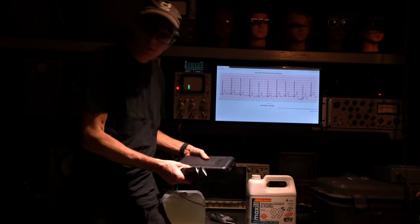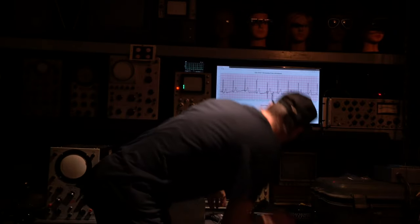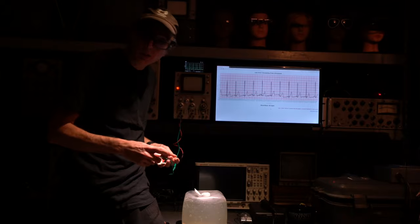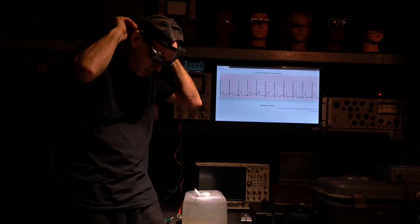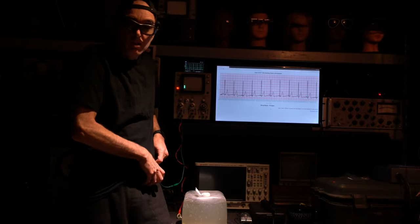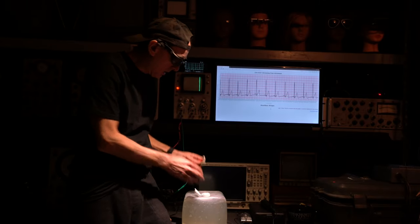You can always have the shaver, shave off first, and then isopropyl alcohol to scrub everything down, and then a little bit of sandpaper as well. Finally some electrode paste and we can put some electrodes on there. These are some electrodes and I've got a cathode ray oscillograph here that will show the oscillographic waveform. The ground is nothing fancy, no driven right leg — we'll have the ground and then the two electrodes to pick up the signal.